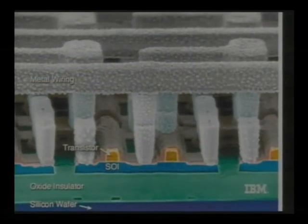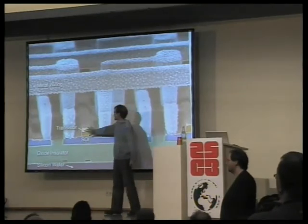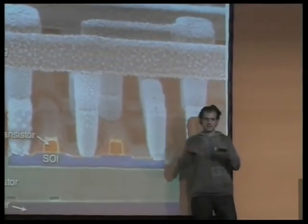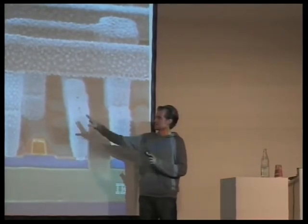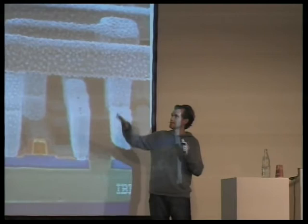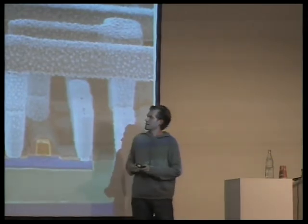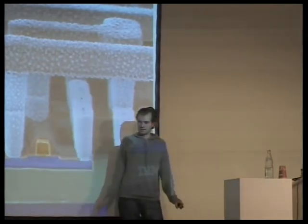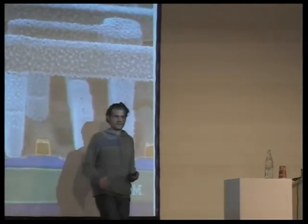Inside the chip, which is where we want to get to, we find structures like this. We find transistors built on top of a silicon substrate, and the different transistors are connected through these metal bridges. So each transistor is a little switch, and these metal bridges connect the different switches, and if you know anything about VLSI, you know that you can build an entire Intel processor using only these components. We want to take pictures now of these structures and reverse engineer the circuit that is described by them. And so we first want to take pictures of all the metal layers and ultimately of the transistors. And for this we need to cut through these different metal layers. So we basically have to cut through here to get to the transistors, for instance.